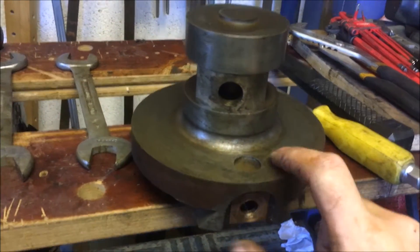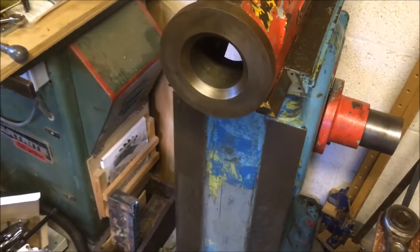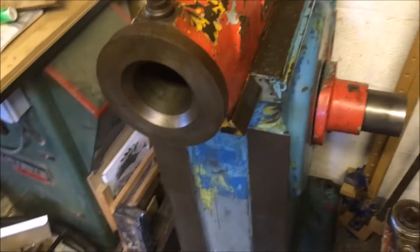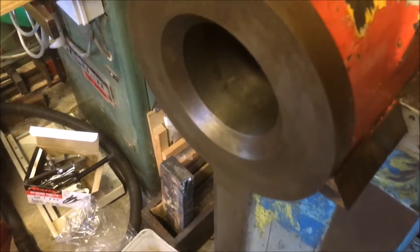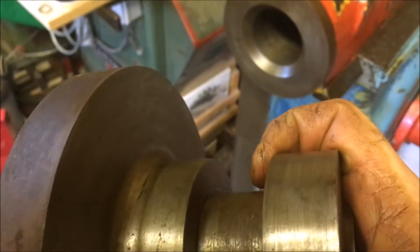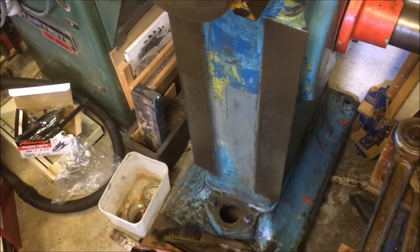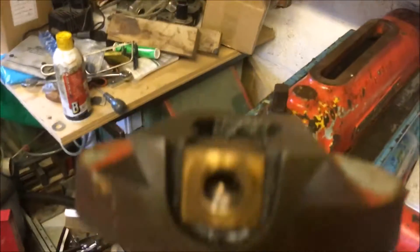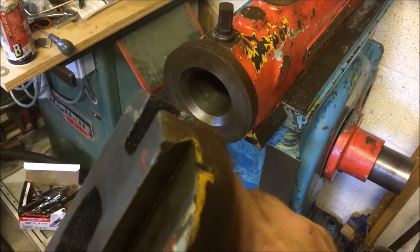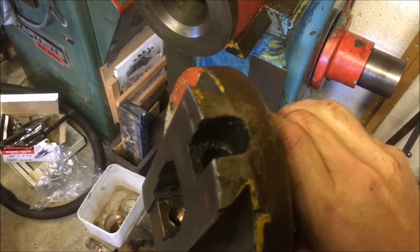The fit between these mating surfaces, on the inside of that bore — it's taken me 20 minutes with a little tap tap tap tap tap behind it to get it shifted. There was a bit of picking up but they look like pretty clean surfaces. You can just see a small amount of pick-up — probably the oil's dried out, I suspect. Nothing damaged. To use Diner Guy Mike's expression, there's a few battle wounds. You can see where the tool head's come back and clunked — it must have rounded into the work. Not too bad though.